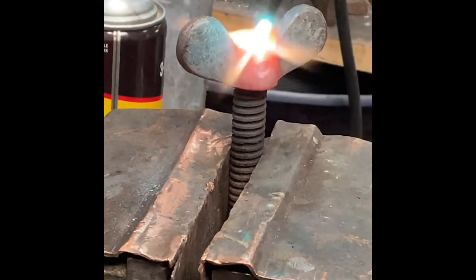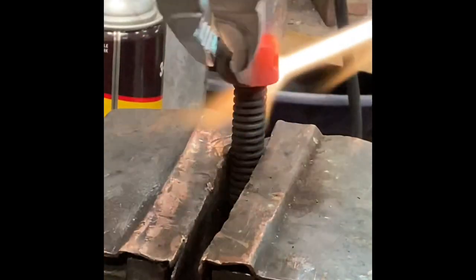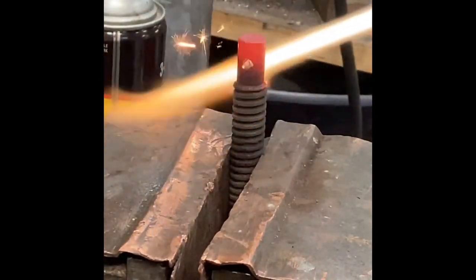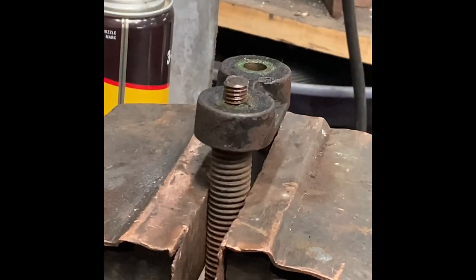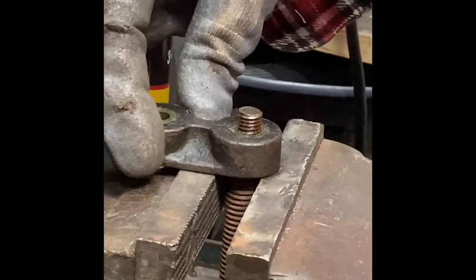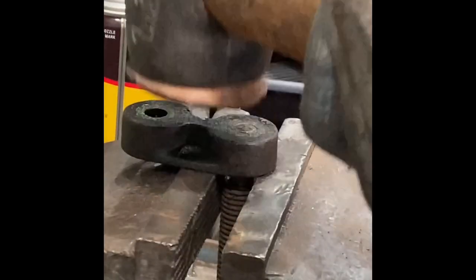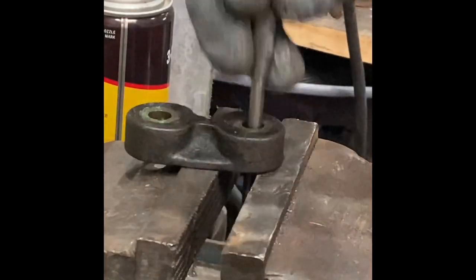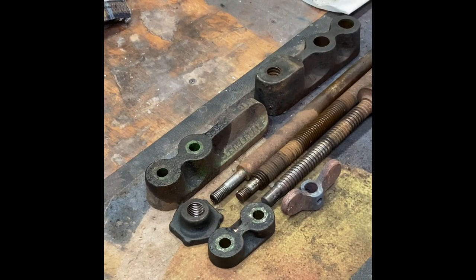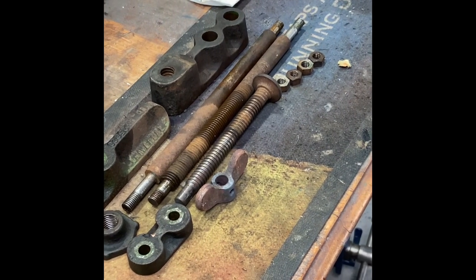Once I felt it was pretty loose, I was able to just lift it off with a pair of pliers. The good thing about this was you take it off without the risk of breaking anything. I'm removing the copper jaws because that's only a small shoulder I've got, the vice isn't tight, and I'm just going to use a copper lump hammer to drive that through — no damage to the threads, nothing gets broken. Here it is all broken down into its individual components. Now I can get on with cleaning and polishing.